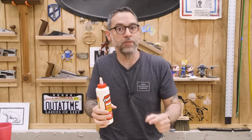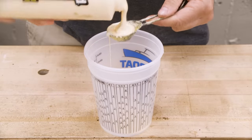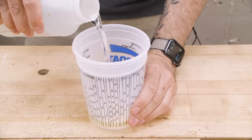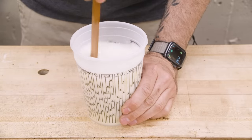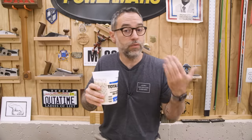Glue size is where we're going to start with this formula, but I'm also going to add diluted finish. Here is what I'm calling the starting point for the formula. First, I add three tablespoons of glue — I'm using Titebond Original, but I think any simple woodworking glue will work. Then I add three tablespoons of water-based finish — I'm using General Finishes, but any brand should do. Now bring that up to a quart with water. I'm going to call this stuff Mark Juice. Pour it on your cereal. I called this a starting point because you could really change the quantities — play with them a little bit. Every wood is different, every finish is different, so this formulation could definitely change. When I do use it, it seems to be the most consistent and the results are the most predictable, which is why I really like it.